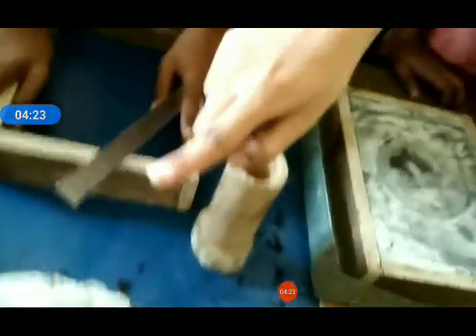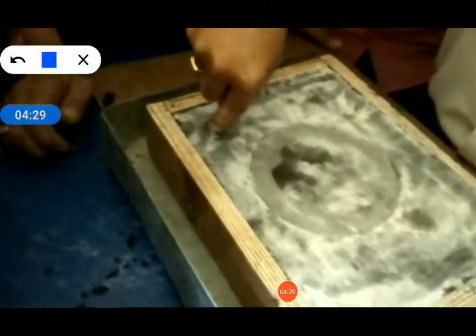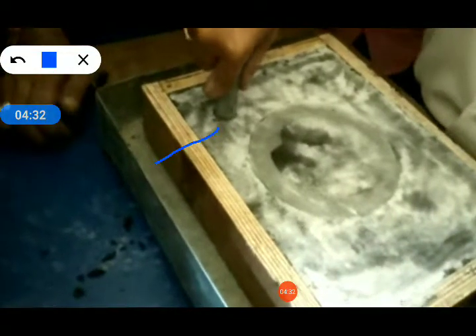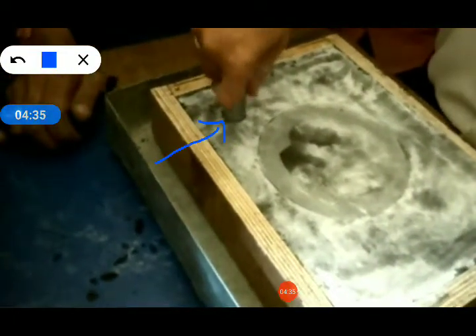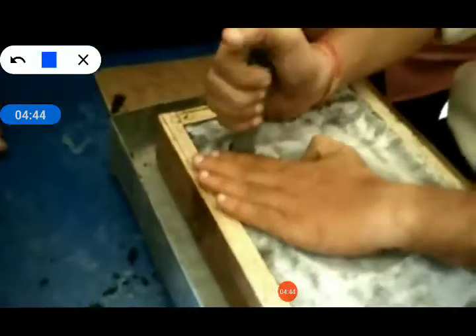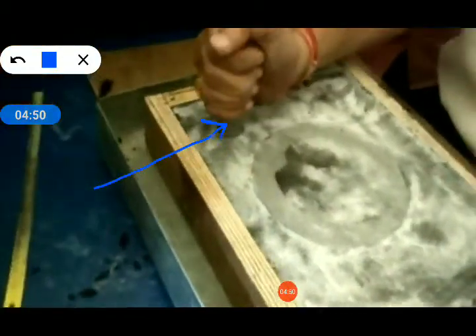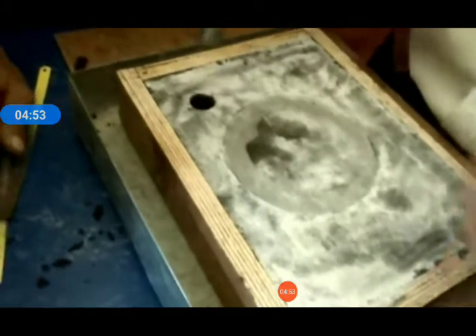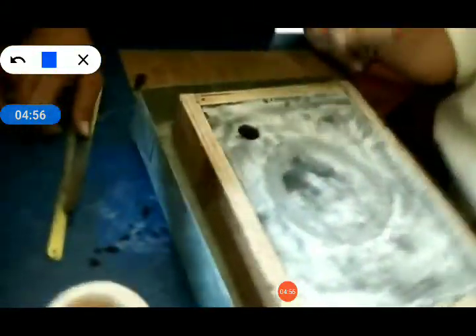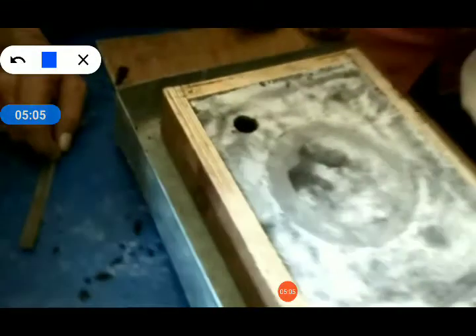See how to withdraw the pattern. Before we withdraw the pattern, we make the sprue. Sprue is nothing but a hole through which you can pour the molten metal. Here, generation of sprue — sprue is a hole through which you can pour the molten metal. The hole can be generated by a hollow pipe. This is a hollow pipe through which you can generate the hole. This hole is known as the sprue.